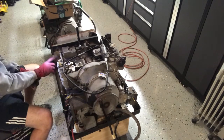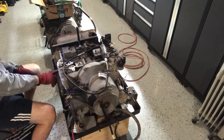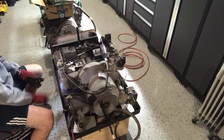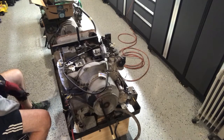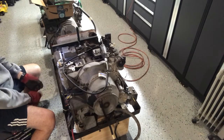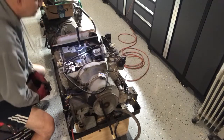We're going to try to get the oil leak stopped. This is the oil filter down here, and it looks like the base of the oil filter is leaking where it meets the engine housing. So we're going to go ahead and pull this off, clean that base up as best we can, and put a new gasket on there. Unfortunately I don't think I'll be able to get my cleaning tool in there, so we'll have to find another way.